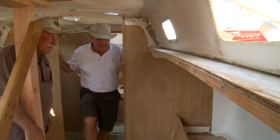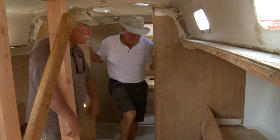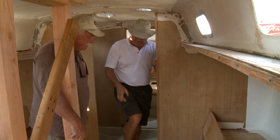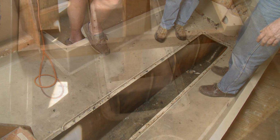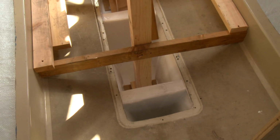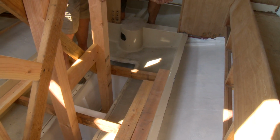Yeah, there's been a ton of work done in here, actually concentrating around the middle of the boat where we're supporting the keel particularly. Yeah, I see some bulkheads that we've talked about adding, and those look beautiful. Now those should take out all of the keel wag, and as you said, we'll find out when we roll it upside down. And these extend all the way up to where the pan and the hull come together.